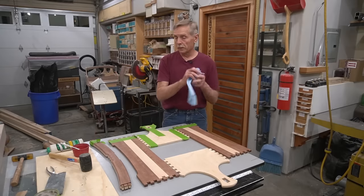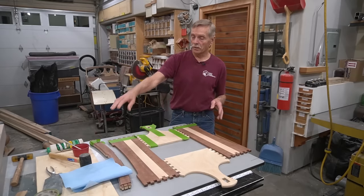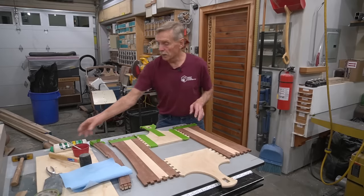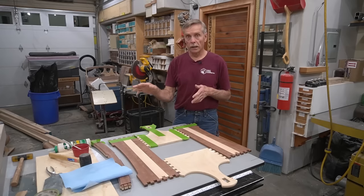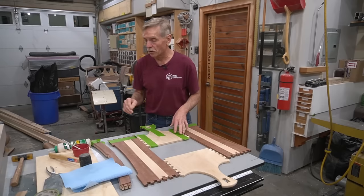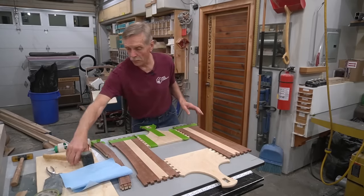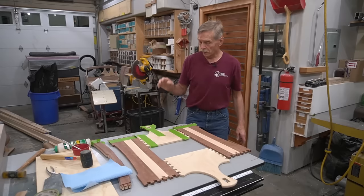I also have a dry paper towel here for the process. I've got a cup and an acid brush. In the cup, I've got dihydrogen oxide that helps keep the bristles of the brush soft while I'm doing this, and cleans them up in between the steps. Tite Bond 3 glue. Got the bottle laying on the side because it's getting close to empty. And I like an older bottle of glue because it's a little bit thicker and it doesn't run so bad on these joints. And I've got a sharpened putty knife there. This piece of plywood is the exact size of the bottom of the tool tote that helps square it up. I've got a rubber mallet for tapping things together and a plastic-faced hammer mallet for driving the tenon wedges.